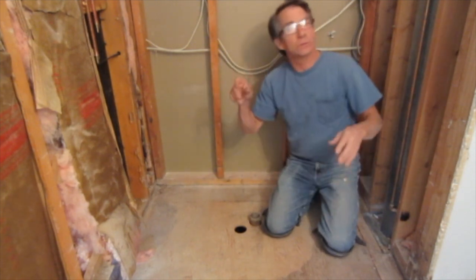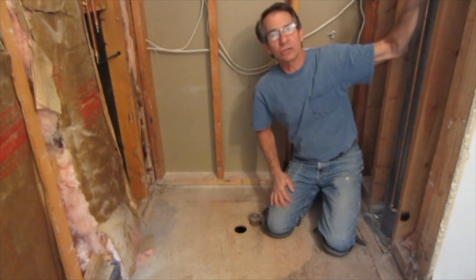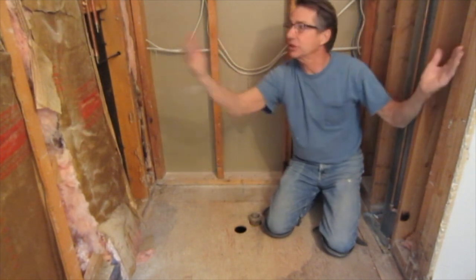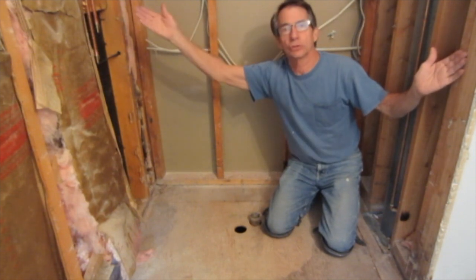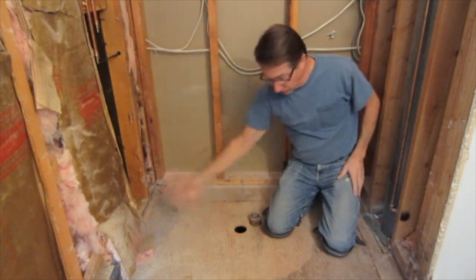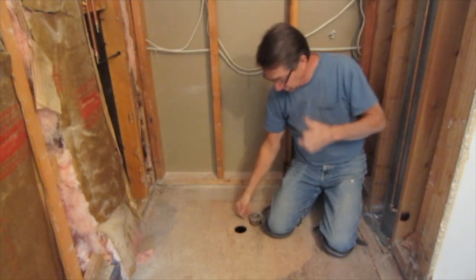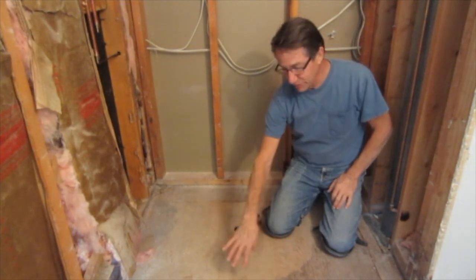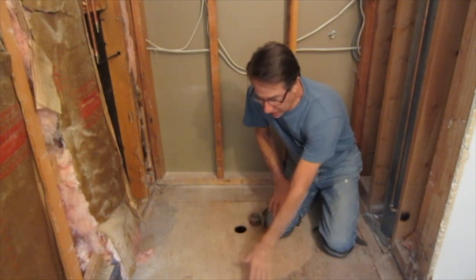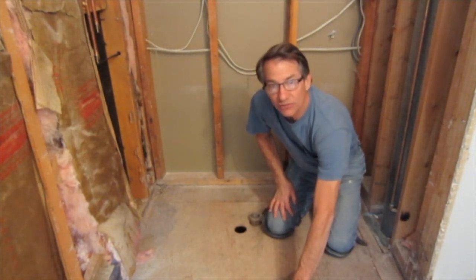In applications like this, the shower mixer and shower head used to be over here. I like to move it over to the other side — with a single pane of glass and a walk-in shower you can turn the water on without getting yourself wet. So I need to run all of my plumbing over to this side to connect, and I need to cut this off and move my P-trap and everything over to where the drain is going to be.